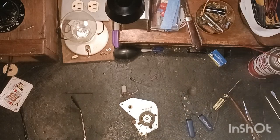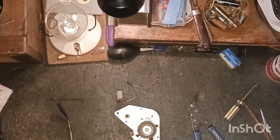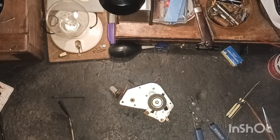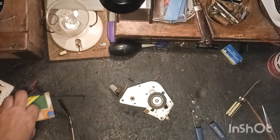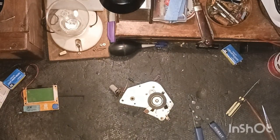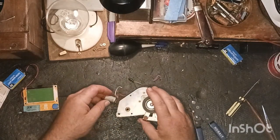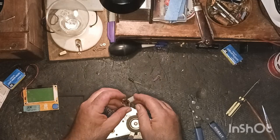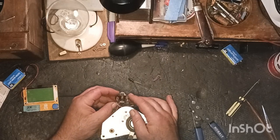Alrighty, guys. Let's see me in a little bit here. Change this electrolytic and we'll check the old one when we take it out, see if it was even bad. Something was going on for sure. Always getting a hum. So usually that's a dead indicator, a for sure indicator that the electrolytic's bad, but sometimes it's not. So let's see how they got this booger in here.